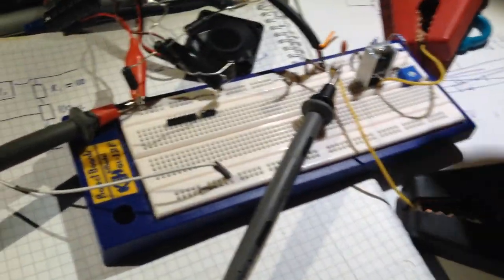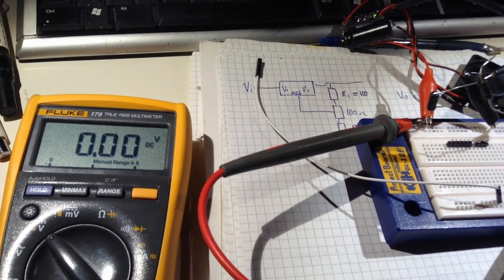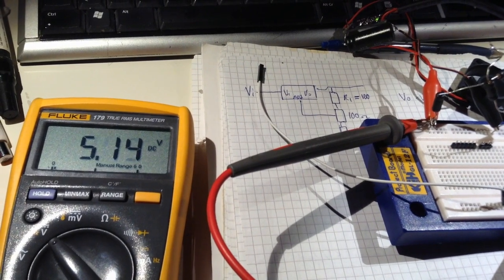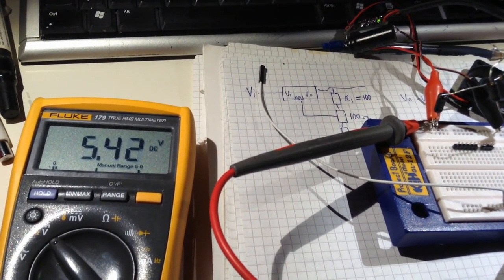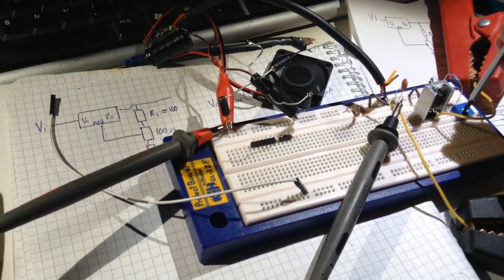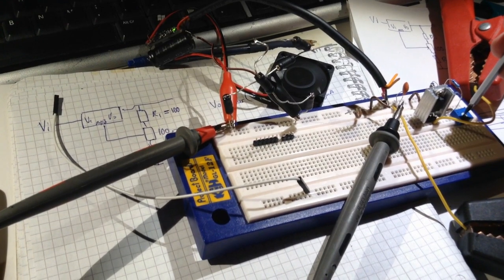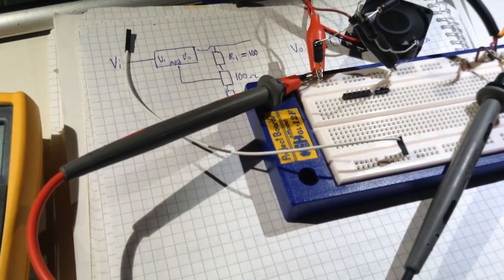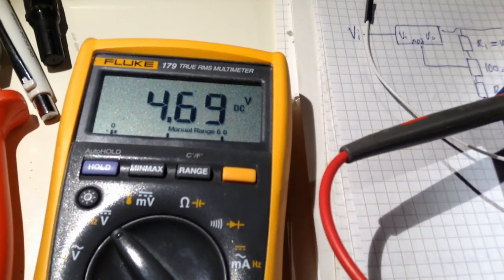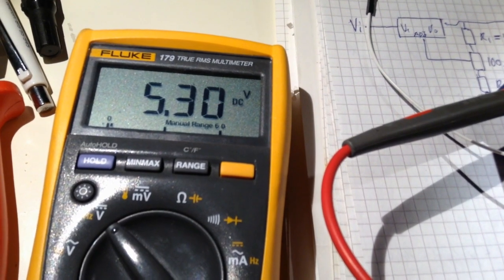Here I am doing some initial testing, adjusting the voltage. I have the 1A regulator, and the way I am pulling the power out of the cable through the red board first means I get a lot of errors in the readings, because there is a lot of loss in the board — for example in the connector there that goes to the Commodore saver, which has like 40 or 50 millivolt drop. So I can't really read out the exact cutout voltage, but I'm very close — it's 5.4 or something, very close to 5.4.